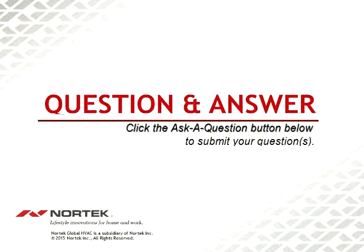Okay, another great question here, and it's kind of a long question. So the question is, if the valve is stuck in one position and the valve moves internally as it should, is it likely that the coil that activates the valve is an open circuit? Is that simply a matter of ohming it out? Yes, you can ohm out the coil, because you're either going to have an electrically open coil, or you could possibly have a shorted coil, or you could have a proper coil.